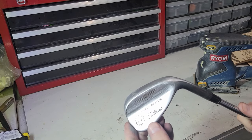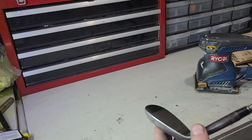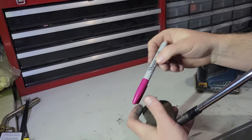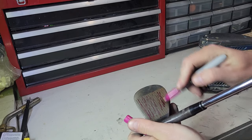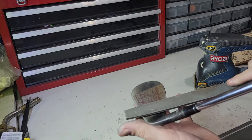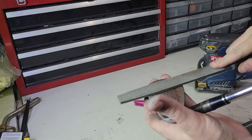This is a couple minutes in — we've gone through and sanded it down. This is still a rough finish at 100 grit. I'm going to go ahead and do the face now. I always start by marking it and get something flat so I can make sure I don't hit any low spots. You can see my face refinish video, but you can simply work in an X pattern up and across.